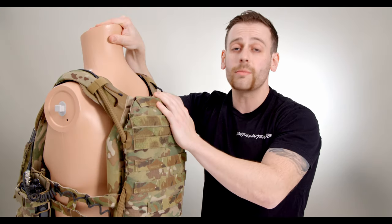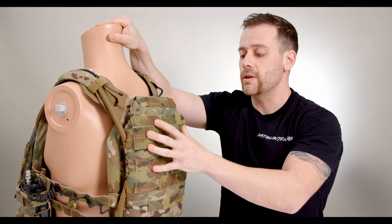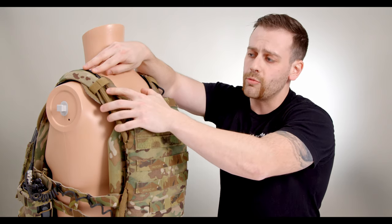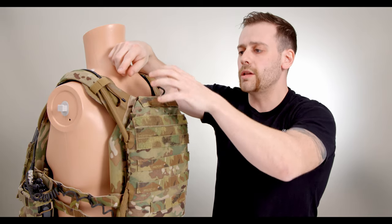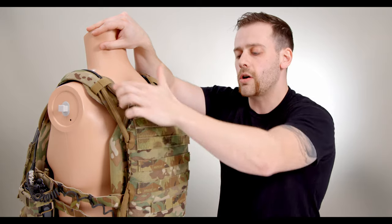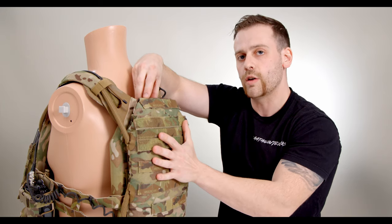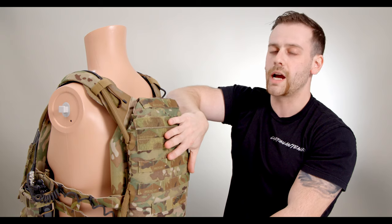Something everyone should be running on a carrier is a hydration source. And the IMS system here is a great solution. Now, it doesn't matter if you have an IMS or just a normal bladder. When you're utilizing one of these wearable antennas that I sell, the longer models or the shorter models, you never want it to be in between or behind a hydration source. So if we had a longer antenna here that had to mount through this panel, we would never want to put it on the carrier and then put the IMS over it. That would be blocking the signals. So in this instance, we would actually mount it on the IMS itself.